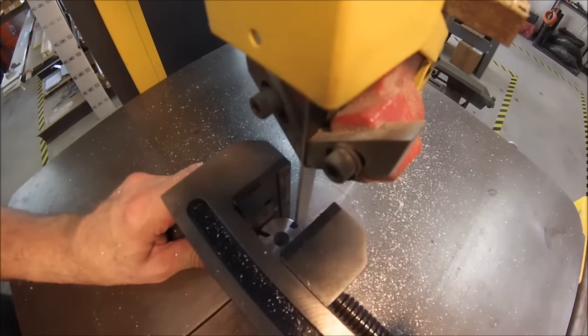Now I know when I did this initially, the black magic marker marks were towards the outside, and there's my key rotation. The chuck key is straight up now, so I'm going to put it back in the machine and turn it just a little bit so the slots are in between the jaws. Now here comes the reason for the shim — put the shim in your part and squeeze down on it until it closes up. If it doesn't close up, make the relief cuts deeper. You want it to have a lot of resistance as you're tightening it down — you don't want it to close easily, you want some resistance.